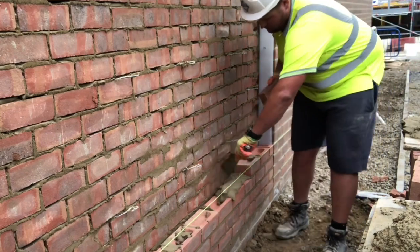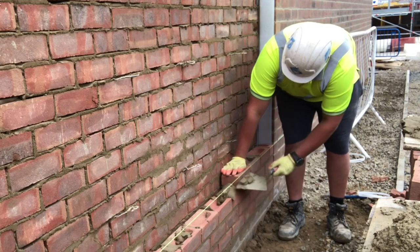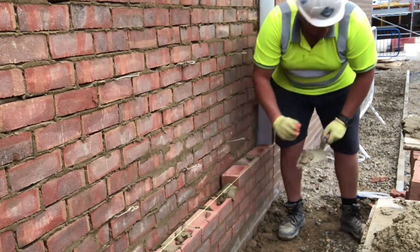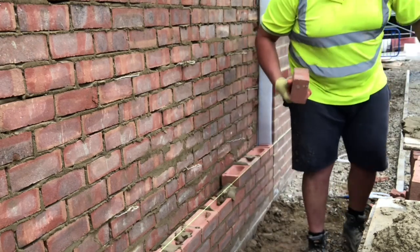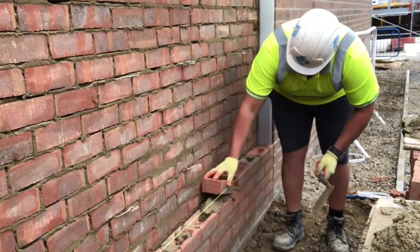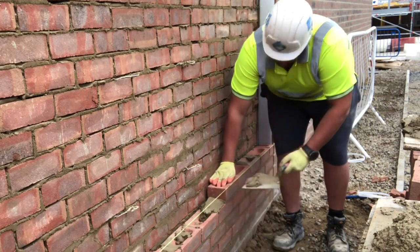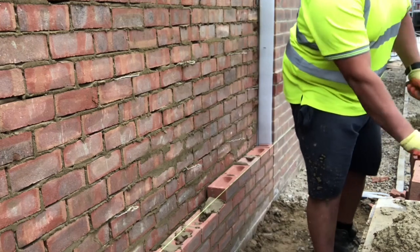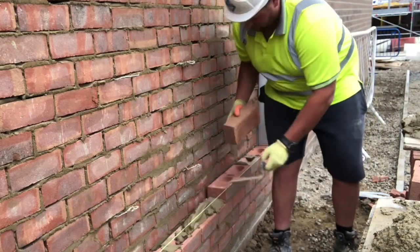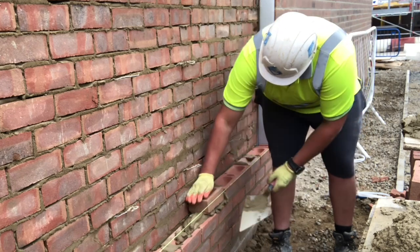What I'm building now, I'm pinned into the house behind me, lined in with the wall, with a big 11-course corner. That's my new favourite height to build corners — 11 or 12 course with a four-foot level tail out. I can get them up pretty quick, and it beats building super corners like I did on the garage build where I did 12-course corners with a six-foot level.